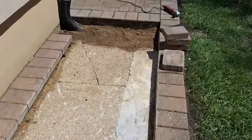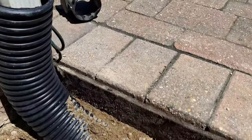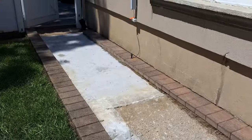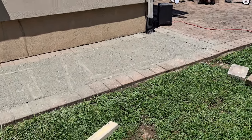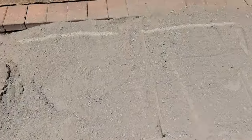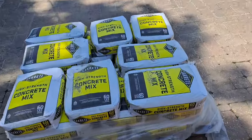I was dehydrated and sweating, and I didn't have enough time to finish because my kids were out for a certain amount of time, so I had to rush through this. Don't forget to get those separators — they go between the expansion joints for the heat and cold so the concrete doesn't crack. This is after about 35 bags are down. You can see it's relatively level. I used a piece of plywood on the bottom and a two-by-four to get some of those larger rocks down as I sifted the cement back and forth.